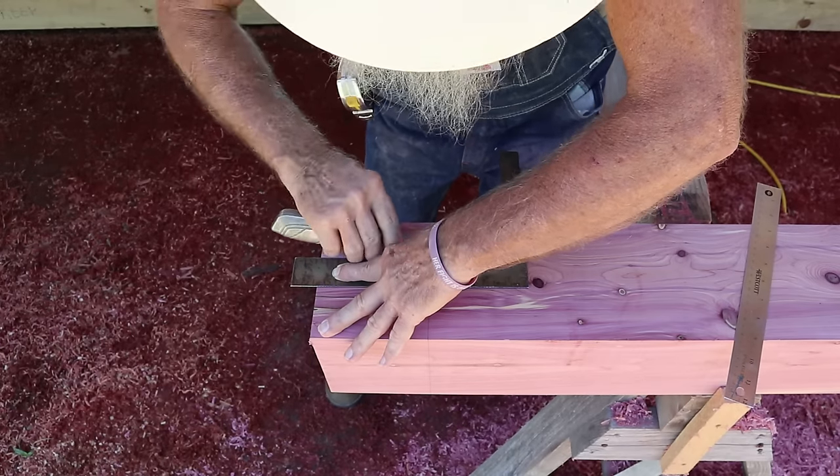A friend of mine told me this years ago and he was right: if you do this part of the tenon first, then when you come back to cut the shoulder, pressing down with your chisel you're always going to be cutting deeper into what you've already cleaned up. So I do the end grain first — if I cut down too much here I still have the chance of cleaning that out. Going below your line actually weakens the tenon a little bit, and we don't want that.